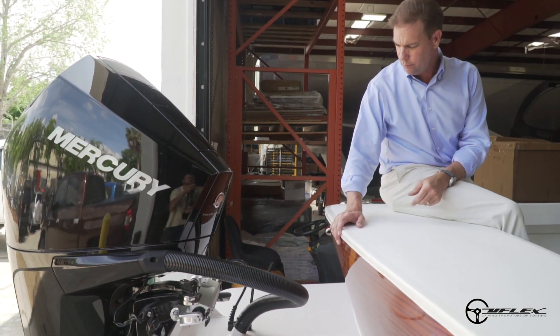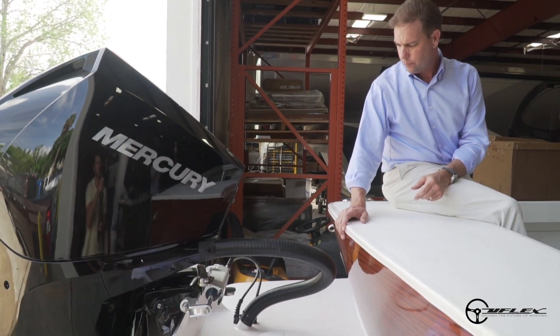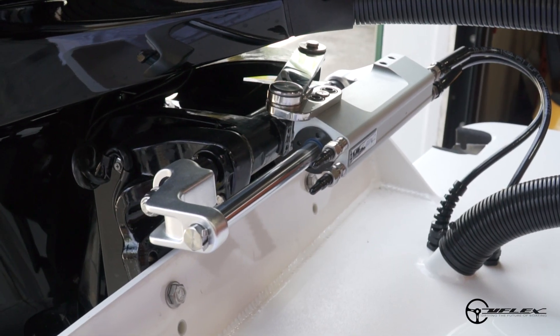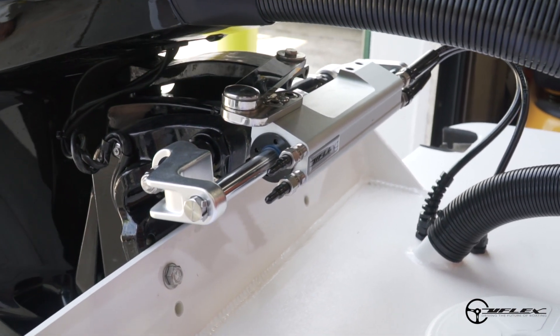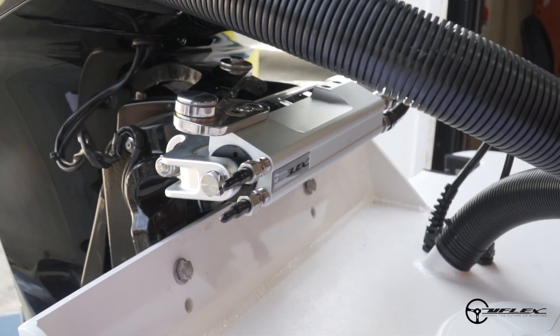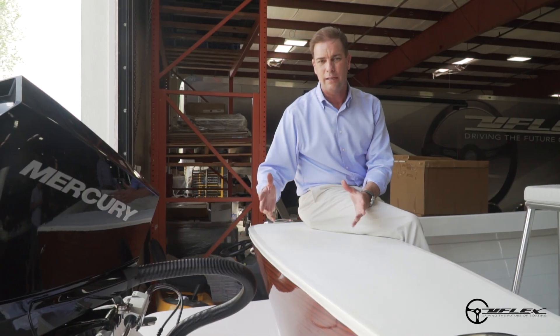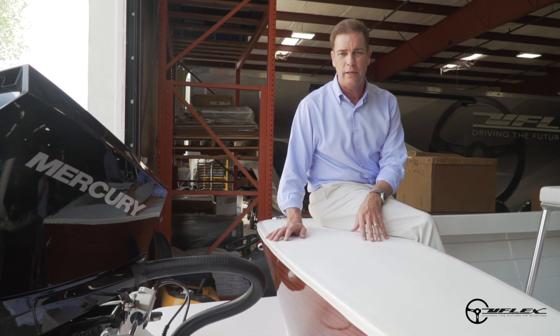Let's go ahead and steer it the other direction. In this direction I also don't see any of the main cylinder rod — it goes right up against the bullhorn. That means that the cylinder is actually making full travel and the engine is not inhibiting the travel of the cylinder. So this one would be ready to go.